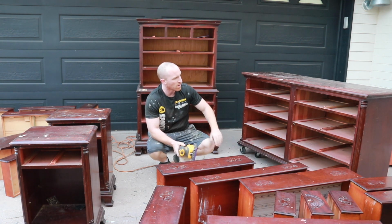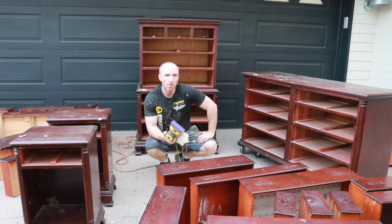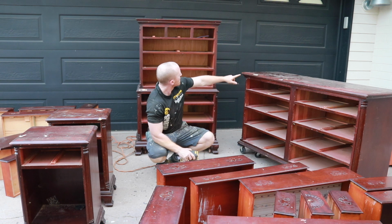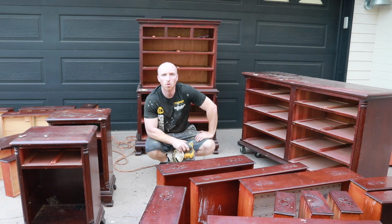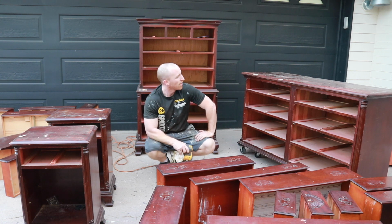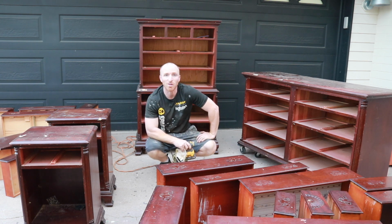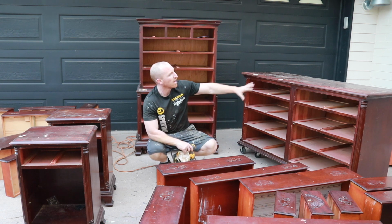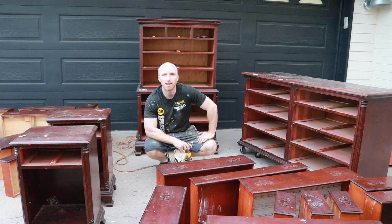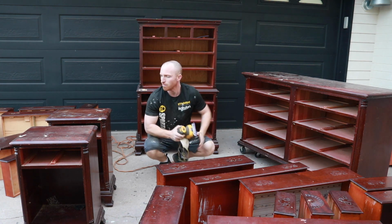So at the tops, everything's gonna get sanded. Anything that I can't get with a straight line, I'll come back and hand sand. You can kind of see on some of these pieces, we've put some wood putty in for little holes, things like that. We'll sand all that out so you won't even know it's there. All the drawers should be pretty quick, since we're not having to stain the tops or anything like that, we're just going to sand it down nicely. So let's get started.